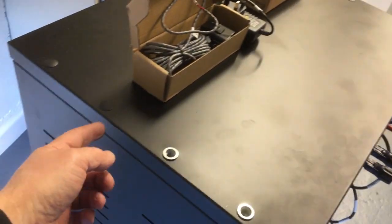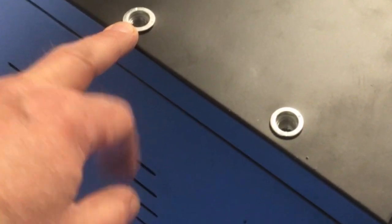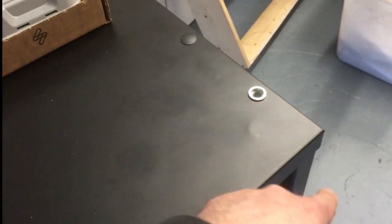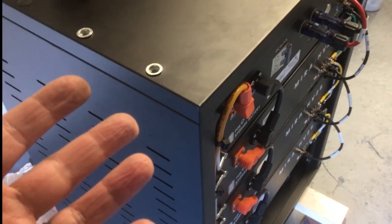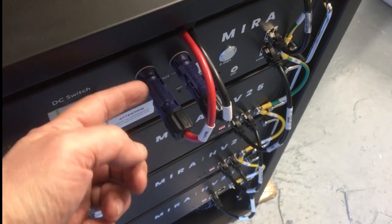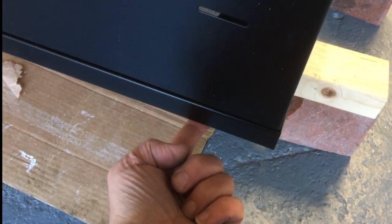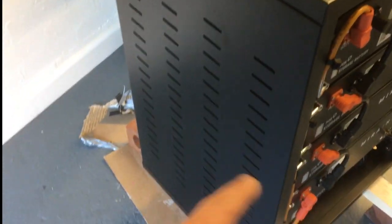It's just one of those growing stories, isn't it — you try to fix one problem and you walk into the next. Because I've allowed in the future to add a door, I've got some rivnuts on there. I need to make some clearance on the underside so it will sit flat, otherwise it'll sit on top of the rivnuts and wobble. The unit comes with access holes that allow you to bolt the top to the sides — it comes as a kit — and they give you plastic caps to cover those over. But I decided not to put them in here. I've installed M10 rivnuts that were a perfect fit, and there's one on the other side in case I want to do something like a magnetic catch — basically for the option to put a door on in the future.